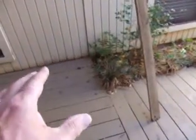This is the wall inspection. We're at the rear elevation. There's some deterioration in the siding here. It's got a lot of water penetration. Now, this raises concerns with me that water has penetrated the wall. You can see down here, around here.